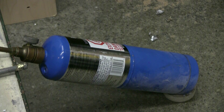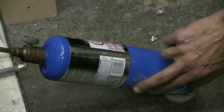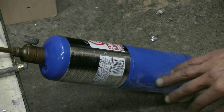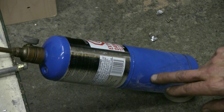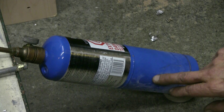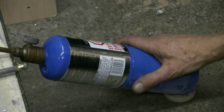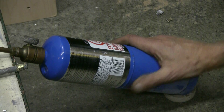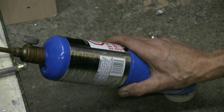If you run off a torch or camping tank bottle like I am here, you might want to keep an eye on your tank and make sure you're not drawing so much propane off that the tank starts to freeze. If it starts to freeze, you'll lose propane pressure and therefore also lose heat. If this starts to happen, it's often sufficient to just put your hand on the propane bottle to warm it gently and the pressure will come back up.